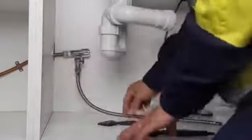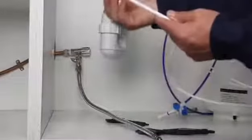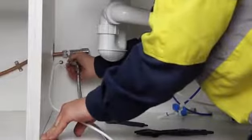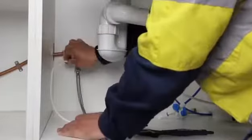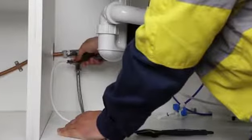At last, cut the PE tube in adequate length for feed water connection. Remove the steel nut from the 3-way shut-off valve, put PE tube through the nut and attached onto the elbow outlet of the 3-way shut-off valve. Then tighten the nut back onto the valve by hand. Then by wrench for another 3 full turn clockwise.